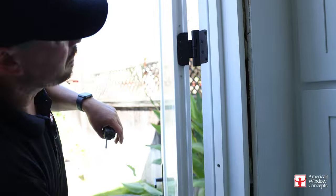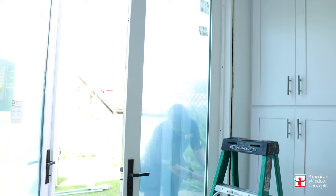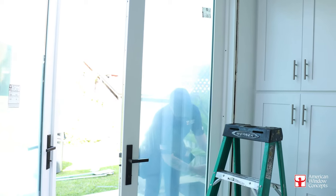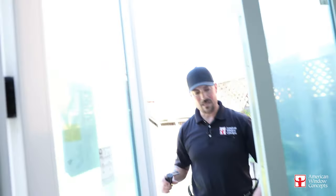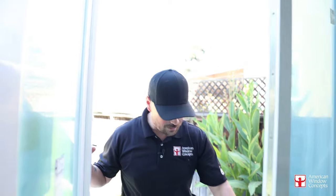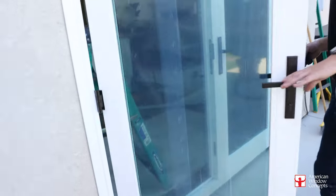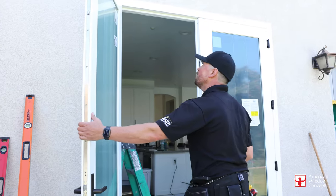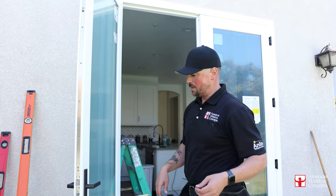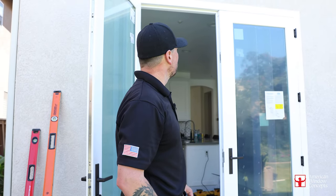But this hinge down here, underneath — you spin that and that lifts the whole door. Sometimes whenever these manufacturers are giving you these doors, they're not setting these hinges perfectly because it's not in a door opening. There are variables, so they leave it for the installer to actually install. Let's take a look at how this closes up. At this point we'll go ahead and just finish the door up — it's all operating the way it's supposed to, locks very, very well.